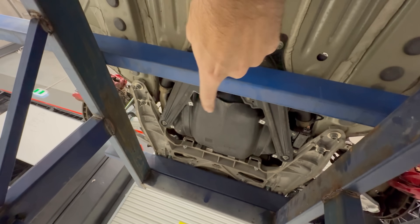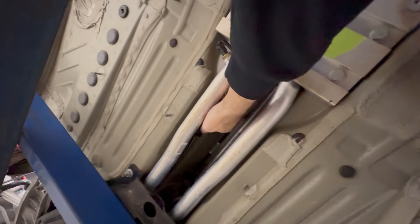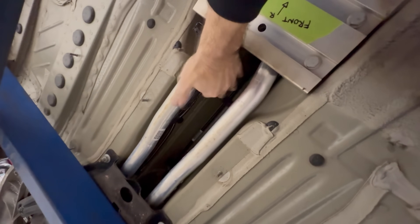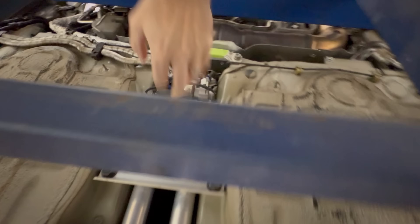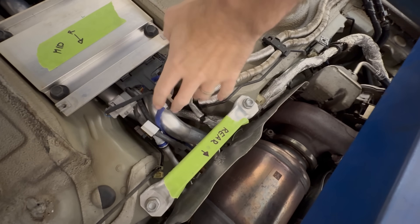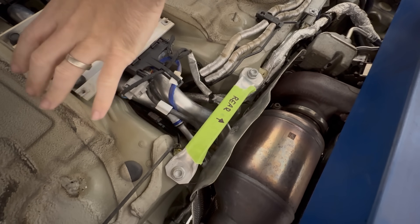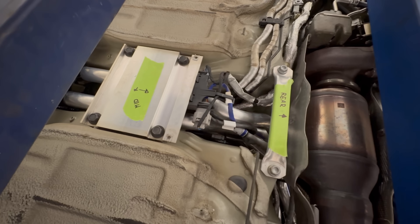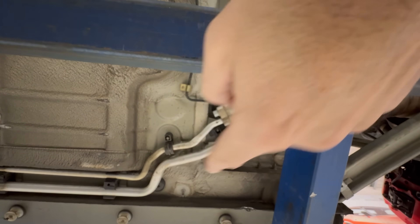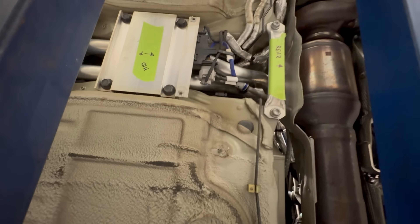Just underneath here, I might look at dropping this fuel tank, and this subframe brace thing here. We'll probably take this out so we can get these two coolant lines. All up in the tunnel there are so many different lines — brake lines, fuel lines, wiring, tubes going everywhere. So all those come out. Get rid of this brace, and the next one. A little bit of wiring in here too. Because we really want to get up into this tunnel. We'll probably remove all this glue seam and all these spot welds around here. So when we shift this tunnel back, we can use all these flanges to re-rivet to. We've got to get all this cleaned out so that we can chop through the floor and not chop through any of these essentials. The AC lines are really convenient — we can just undo this one and undo it here, so this will just drop out.